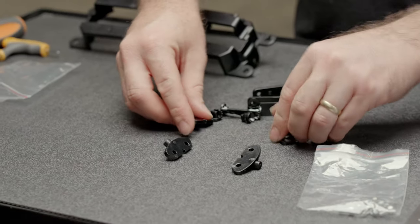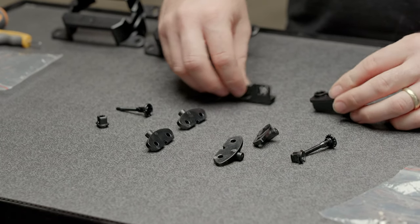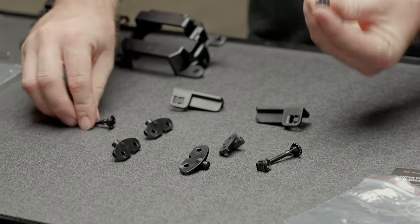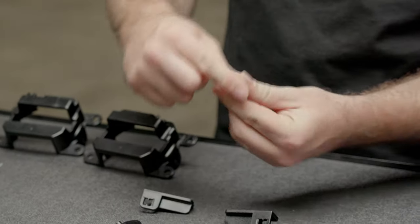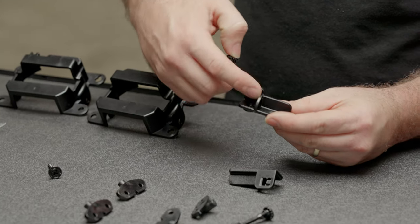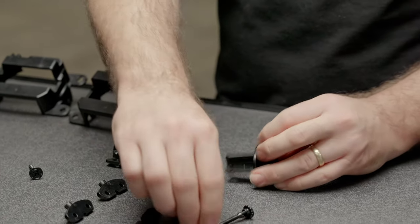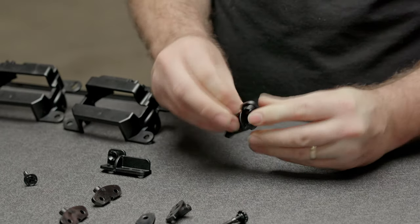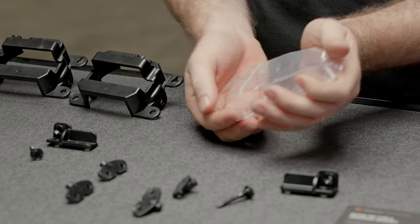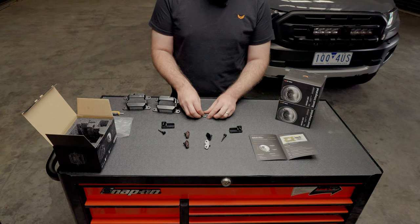You have your pivot lugs, your adjustment screws, and your adjustment screw holders. Your female thread is here and your male thread is there. This small piece needs to click into this piece — so on this concave inner side, click this into place and put that aside. You'll have 12 bolts; they are M4 by 8mm and you'll need a 3mm Allen key to tighten these down. Just set half of them aside for now.